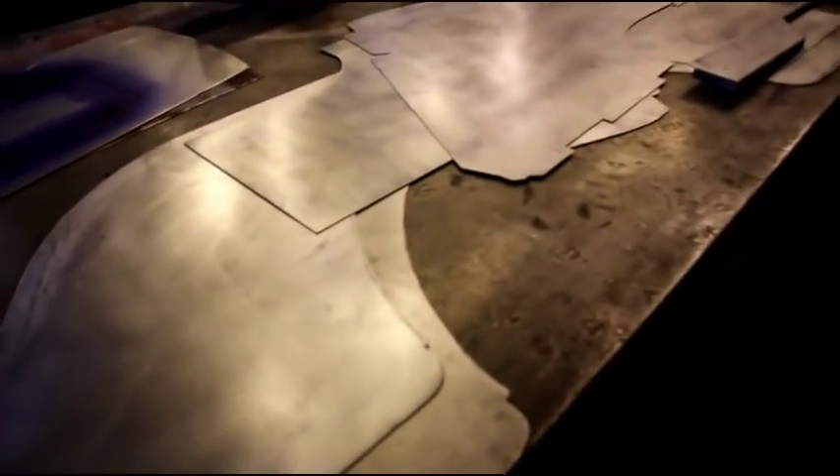I got all the pieces cut out of that one sheet. Everything is cut out, sanded, and ready to be made into panels. I've got the left rear quarter, right rear quarter, same thing on the front. That's the front panel with the step. There's the rear cross sill — I already made it — and taillight panels. All of that came out of one sheet of cold rolled 18 gauge.